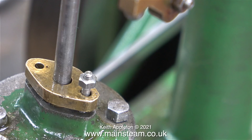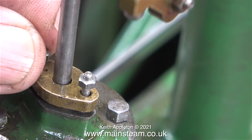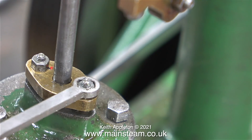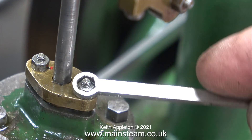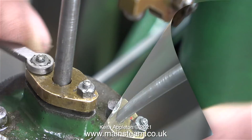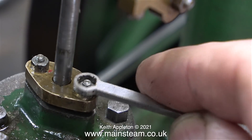To hold this flange in place, I'm fitting some proper studs. I can't be doing with the small bolts that just don't look right. These are genuine Stuart studs and are designed for the job, as you can see. The secret of successful gland packing is to first of all wind the correct amount of yarn around the piston rod or the valve rod, and when you tighten the gland, tighten it fully, and then back off each of the nuts a very small amount.